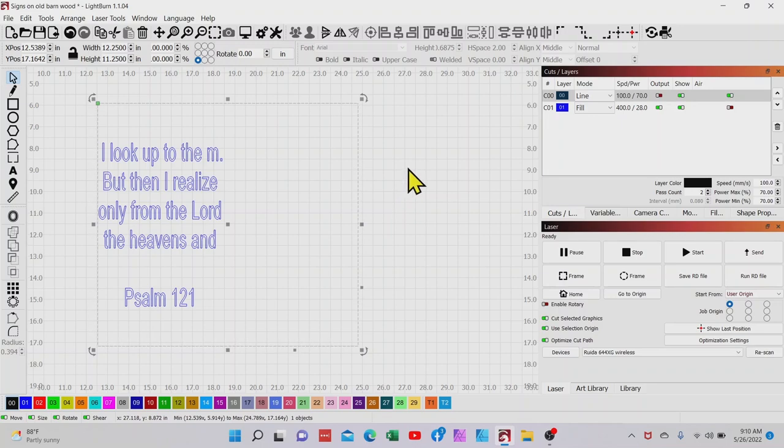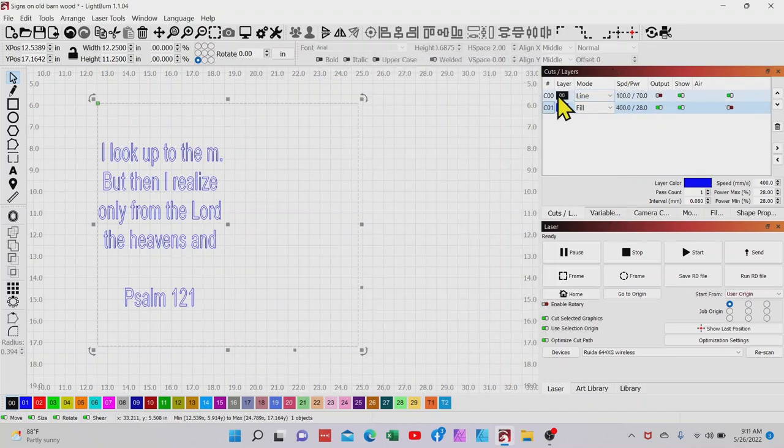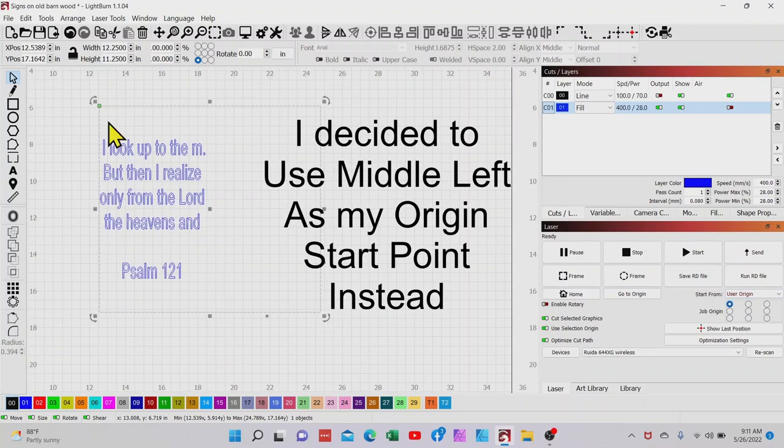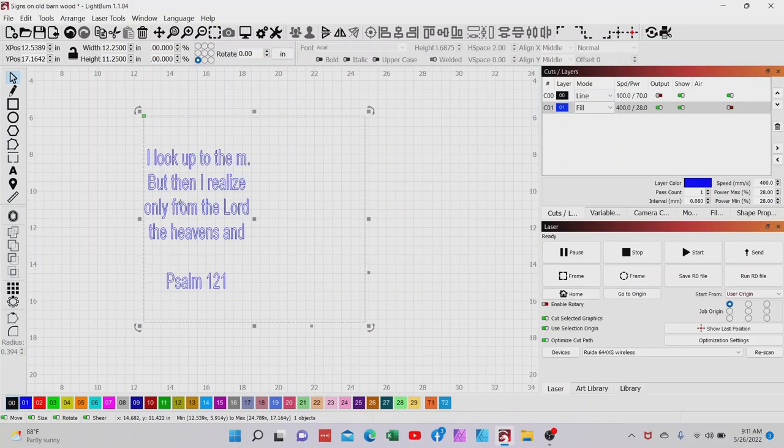I'm running a Thunder Nova 35 100-watt and my engraving settings are going to be 400 millimeters per second at 28 percent power. I'm going to do 317 lines per inch. At the laser you're going to see that I'm going to try to balance the focus. My air assist is going to be off. My black layer is strictly for reference — it's just illustrating to me the piece of wood in my laser. I'm using user origin with the upper left-hand corner, so when I go to frame this up I'll drive the laser head to that corner, hit origin on my controller, then frame and give this a try.